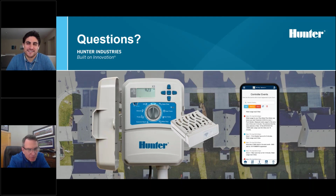Let me see, got one more. Will the X Core still be available? So yeah, the X Core is still available. One of the main differences between the two, full disclosure, the X2 as a standalone controller is actually a little bit more affordable than the X Core controller today. And the main reason behind that is there's no solar sync dial position in the X2 controller. If you want to use the solar sync type programming, plug in that WAN module and use internet connectivity and weather station data for that virtual solar sync.